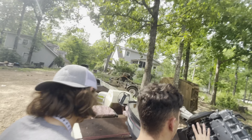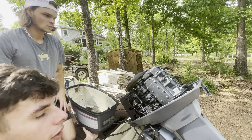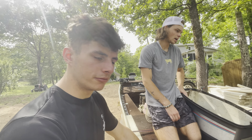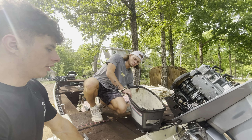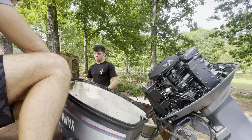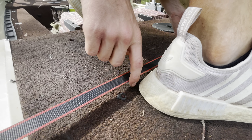It's got a 50 Yamaha on the back. They got rid of the oil injection Precision Blend system because they break, so now there's just a normal tank and they pre-mix the fuel before putting it in. That sucks when you're on the water, but they bring an extra gallon can. They've already taken it out — this thing runs immediately, it'll start right up.